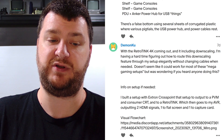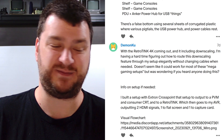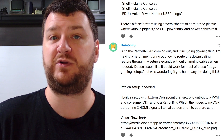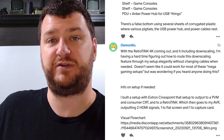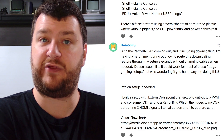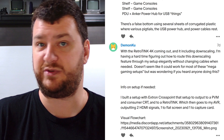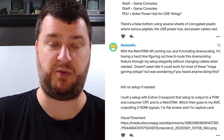You really just need to decide what you want to do on the HDMI output side. I did take a look at your flowchart — that looked very complicated, well done. In a perfect world, you would get an HDMI matrix switch to replace your main switch — something like 12-in, 6-out or 20-in, 6-out — so you can go to all your displays, but also route back into the RetroTink 4K. Any of your other HDMI devices can go through this, then back into the Tink's HDMI input. On the output side, you could send multiple outputs to multiple displays, but also send one to a digital-to-analog converter and route that back through the Crosspoint.